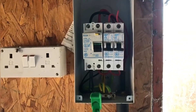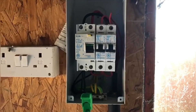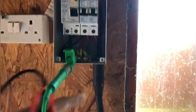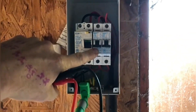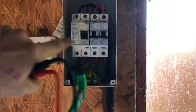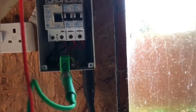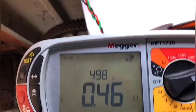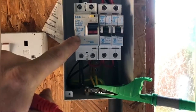I'm going to carry out some testing on a consumer unit in a garage. It's fed from circuit number five in the house on a 20-amp circuit — you can see it's an armored cable feed coming in. We've got socket circuits on a 16-amp breaker and lighting on a 6-amp breaker, and obviously we have the RCD. I'm just going to confirm the ZDB or the ZS for circuit number five, and that's reading 0.46 ohms, which we're quite happy with.